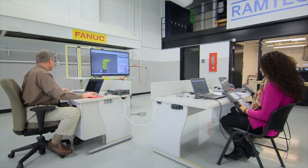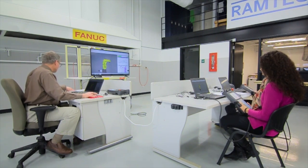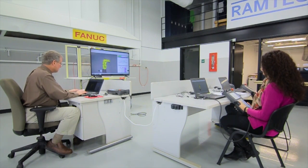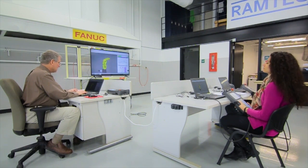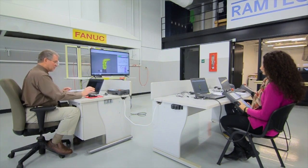Hold shift and now I can move the robot in joint jogging: the waist, the shoulder, the elbow — joint three. You can see the different joint keys being pressed on screen. I can move the arm — joint four — the wrist — joint five — and then rotate the tool plate, which would be considered basically the hand. That would be an example of joint jogging, which is something you'll be doing in just a moment.